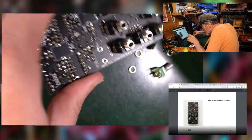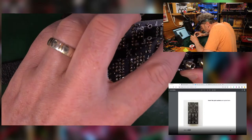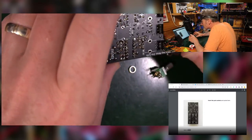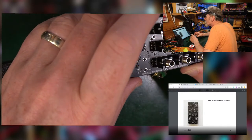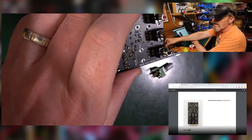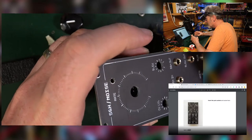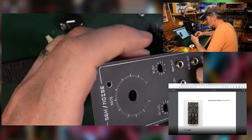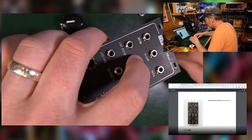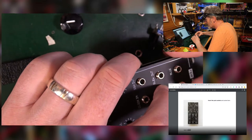Is that the lot? Yeah, I've got extras because I've been using two kits for various reasons and I borrowed some from somewhere else. Anyway, so that's that array in. Now it suggests that you just turn it over and solder them, but what I like to do is put the front panel on at this point because it enables me to keep it a little bit together because I tend to solder these things in wonky if I'm not careful.